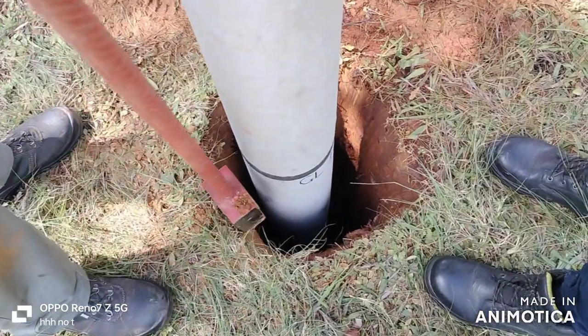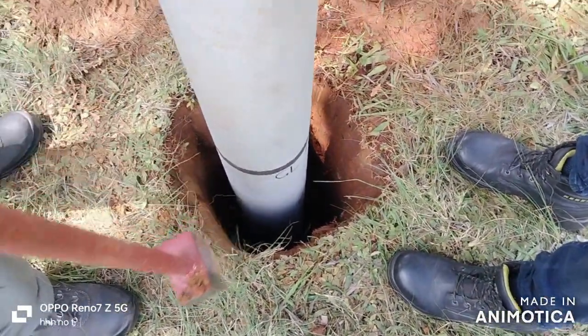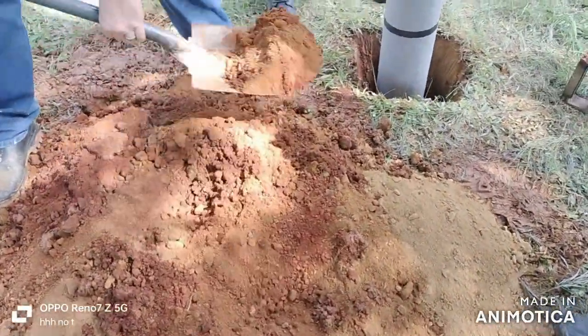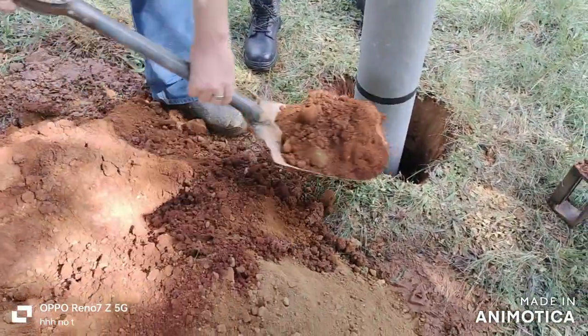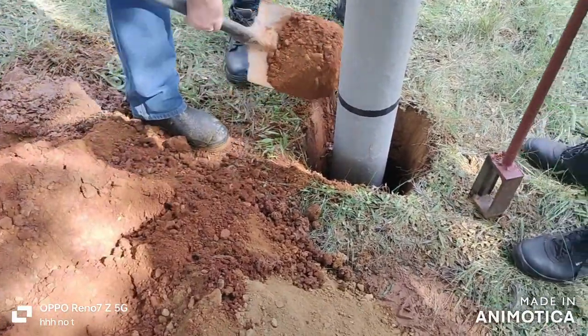See what I was talking about — if this pole is not going to be right, you're going to have problems on this side. We need to make sure it's centered. Also make sure your soil has got enough moisture inside for proper density when you do compaction.